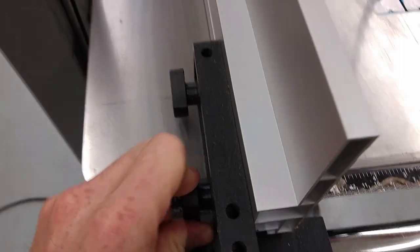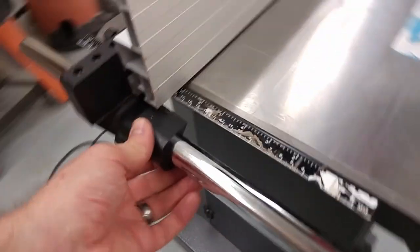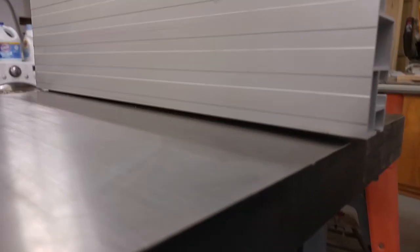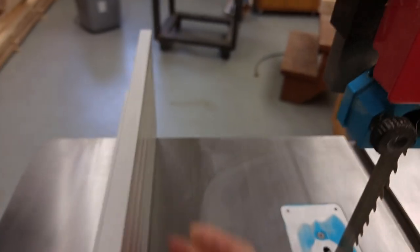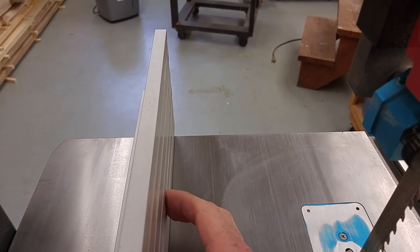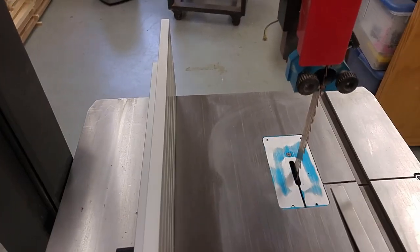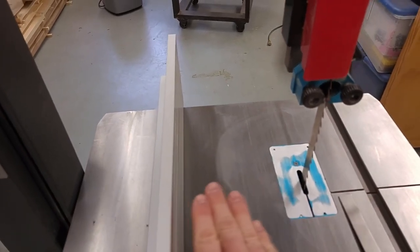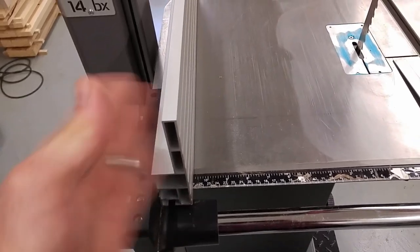To adjust the fence squareness there are two little set screws inside — they might be in the shadows. If you loosen the knobs on the side, the fence body slides off so you can access them — that's also useful for cutting smaller pieces so you can lower the guard farther. Those set screws are right there and there's one on the bottom too. When you adjust those set screws it pushes the fence in or out to make it level. As you tighten the fence it tightens first in the front and kind of pivots, then straightens back up.